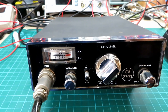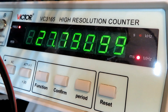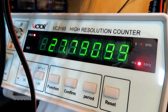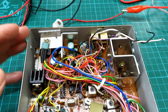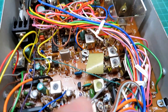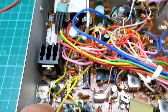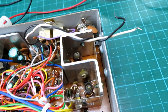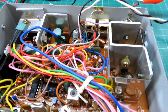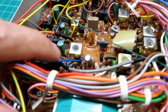Let's check the frequency — that's pretty good, 27.791. That's well in spec; we'll probably just bring that up a little bit but it's still well inside what's allowed. Now, there's an incredibly stiff case to get off the top here. Looking down into the cores, I can't see that screwdrivers have been in there. It does have a relay — transmit and receive. I can't see any bad capacitors on first visual inspection, no bulging ones, though there may have been the odd one changed — I can see a different grey coloured capacitor, which sometimes does happen.